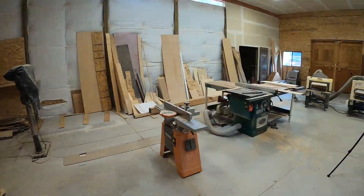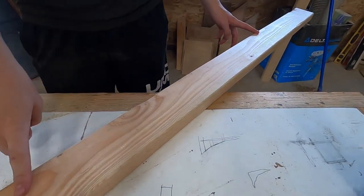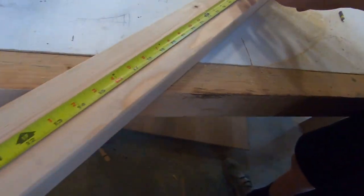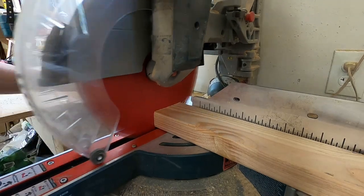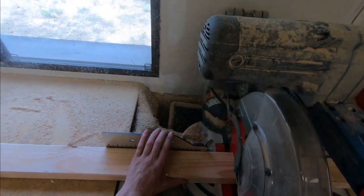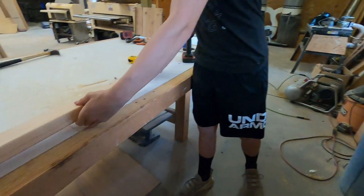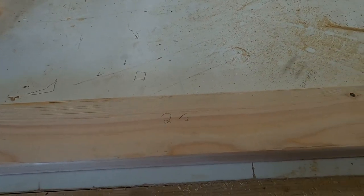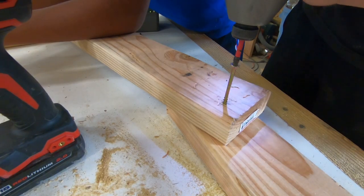Once back at the house we moved everything into my dad's shop to begin working on the jump. For all the safety people watching this, my dad is a carpenter so I know how to safely operate all of these tools. I wanted to make something simple and cheap so I decided on a kicker ramp of sorts. First we cut three different sized sections of 2x4: one at 2.5 feet, the second at 2 feet, and the third at a foot and a half. These three sections would be the slope of our jump, which we made by angling the pieces the way we wanted, then screwing it into place with two 1.75-inch screws.